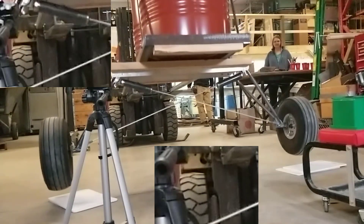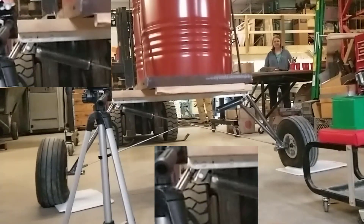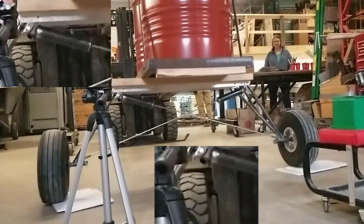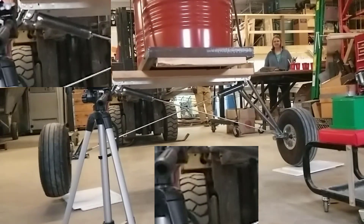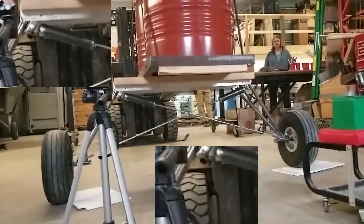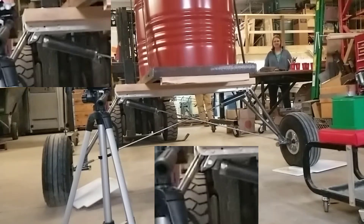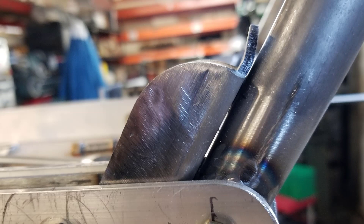We have a rig weight of 220 pounds and a water load of 920 pounds, dropping from a wheel height of 16.6 inches. The plastic cutting boards worked properly, allowing the gear to splay out. We found that the load was not put entirely into the tires before the spring took the load, as in the previous test — this is due to the spring change and the lateral movement of the tires.